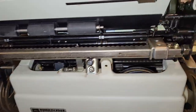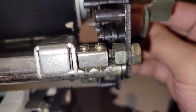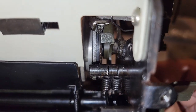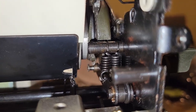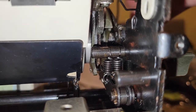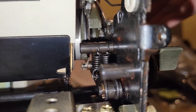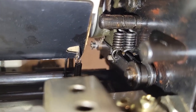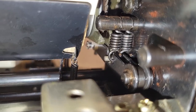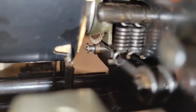The escapement dogs are still hidden from view. On this side you can see — here we have that knob here. I see now: it's basically just a guide controlling how far, or at what point, the pawl descends into that ratchet. Two settings here for the detent — that guy gets pulled out of the way, well pushed, by cam.